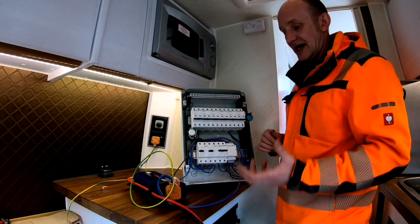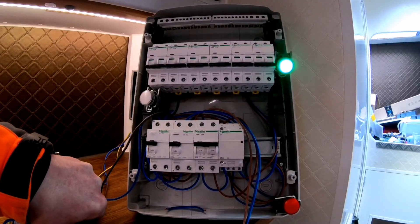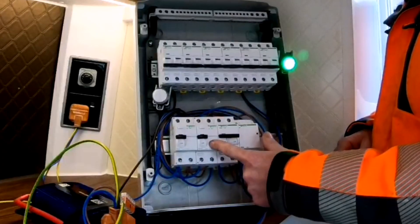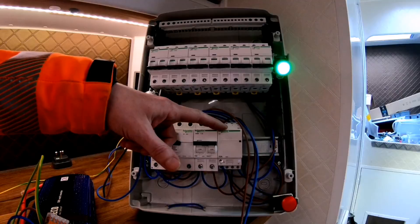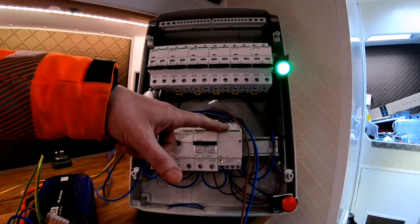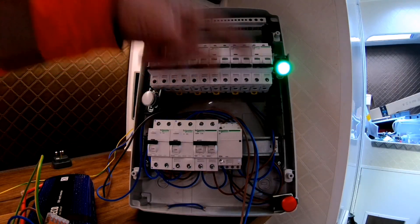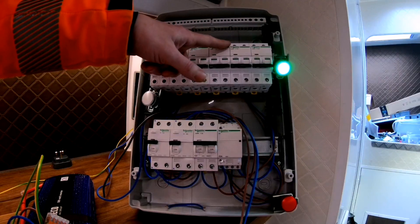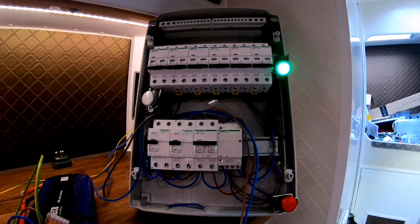So firstly, let's go with your standard inverter power. If we turn the inverter on, there's your inverter power coming in through your RCD. From your RCD, straight through to the contactor — in its standard state which is normally closed. From the normally closed, you go up. At the moment we're going to a green light for indication, but that would go to your neutral busbar and the live would run across your breakers to feed our accessories. And that's how we are in our default state.